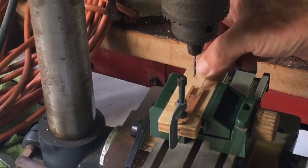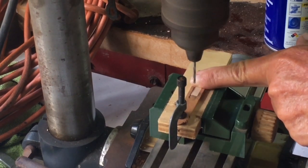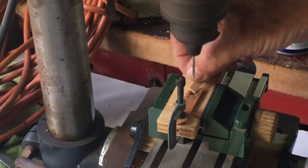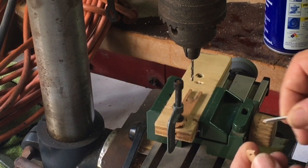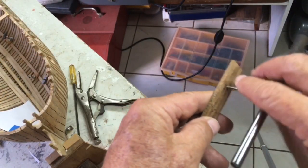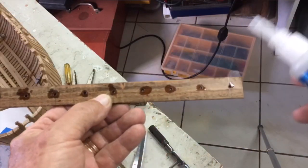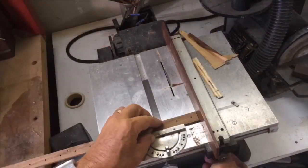To make this up, we made a little jig that we could drill the holes in, wanting a real nice tight fit on the top movable part of the clamp. We did this on the drill press and repeated it to make about 20 of them. When drilling the hole, you just want to make sure it's a fairly tight fit so you don't get a rocking motion. Then we took some hardwood, drilled some holes, tapped them, put some CA on it to make sure the thread doesn't wear too much, tapped it again, and finally cut them out.